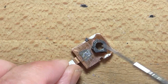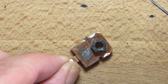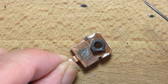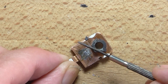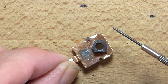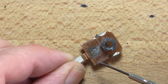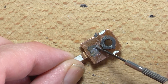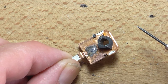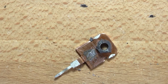Bits are falling off. So that's what's inside this little transistor, which is what blew up. You can see they've used copper here — that's basically for heat transfer; you can use copper as a heat sink. It's just tinned on the other side. Yeah, that die looks to me like it's way too small. It may handle the voltage, but it definitely will not handle the current. So there you go — that's inside a fake transistor.